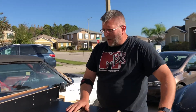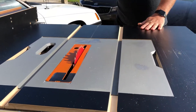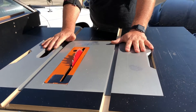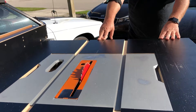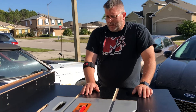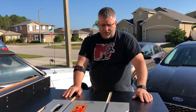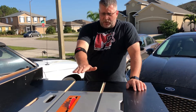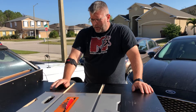As far as making the table saw, I had to do some modifications to the actual saw itself. Because of the way the controls to raise and lower the blade and set the angle were all located right here in the front — this is a Ridgid table saw, which I really like — I had to extend everything out in the front, which took some time and engineering to get the clamping mechanism for locking the angle and the blade height to function properly. Eventually, all of that is going to go away from manual controls and be controlled with stepper motors and a microcontroller, so you'll enter the exact height you want and the blade will actually move to that exact height. If you want a specific angle, you'll enter it and it'll move to precisely that angle.